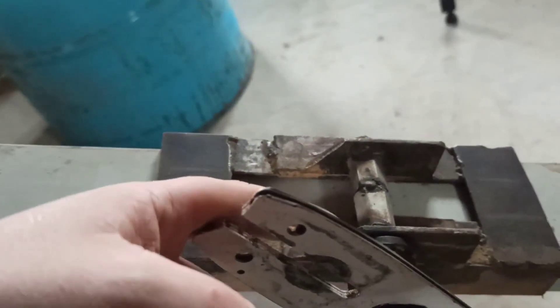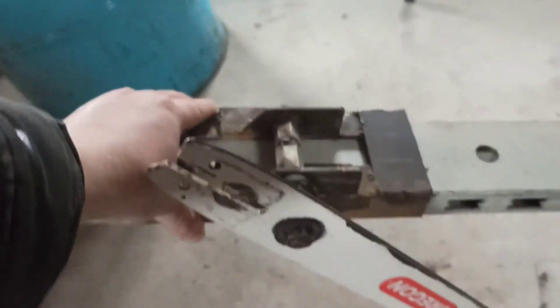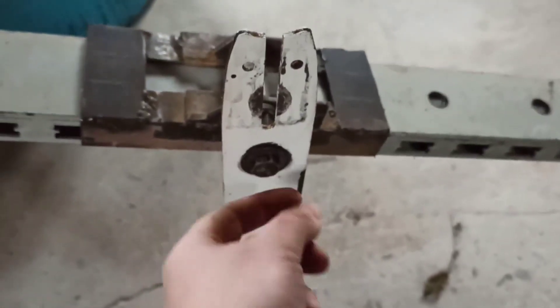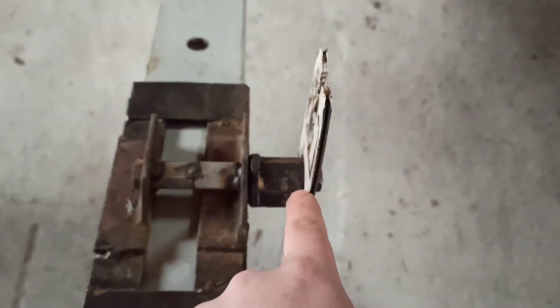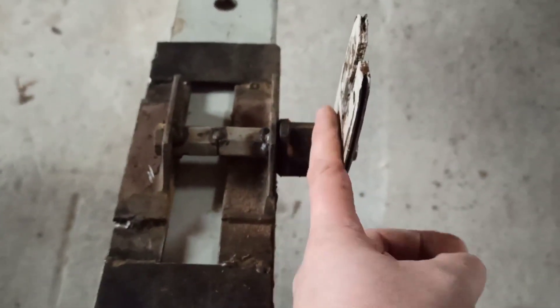You want to install the chainsaw as low as possible, as close to the frame, just to avoid vibration. I simply decided to drill a hole — that's the easiest approach — and put on a strong bolt. I have different types of spacers because this beam I installed to the log with just a couple of screws. Sometimes I notice that if I start cutting I would be cutting in a place I don't like, so I make the spacer smaller or not.